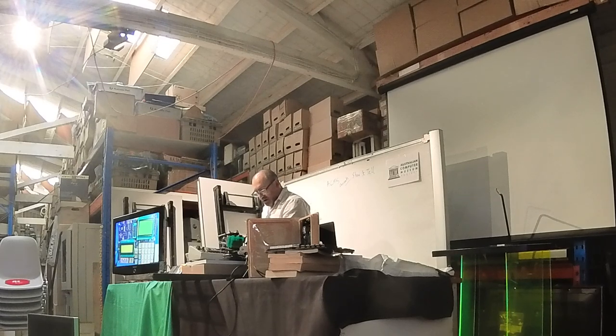All right, but we want to change the code, but we don't want to retype everything out again. So I want to write a program that increments or changes the segment, maybe from 0 to 256 or counts through it. So I need a particular counter. I'm going to use register B now.